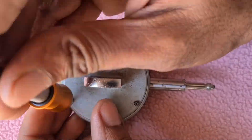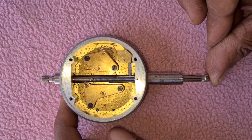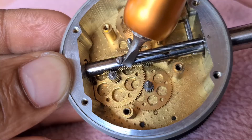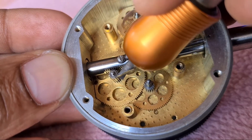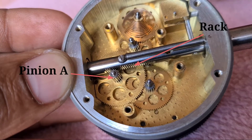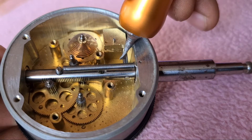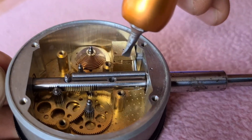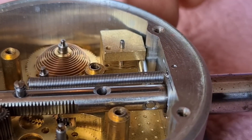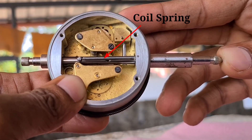Let's check the inside of a dial indicator. The plunger is a perfect sliding fit in its own bearings. It carries a rack which accurately meshes with the pinion A. The rotation of the plunger about its own axis is prevented by a pin located in a slot in a rack guide. A light coil spring is employed.